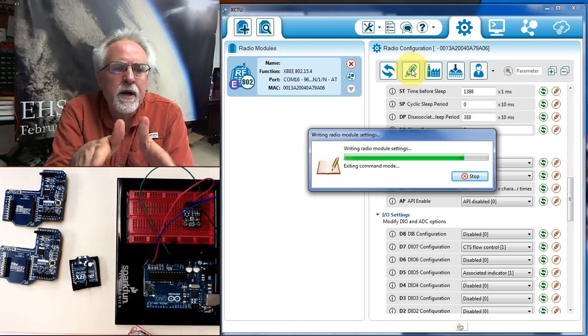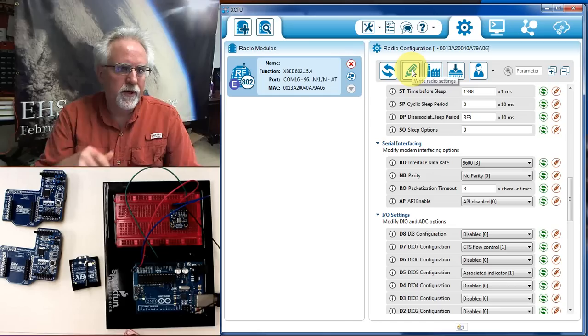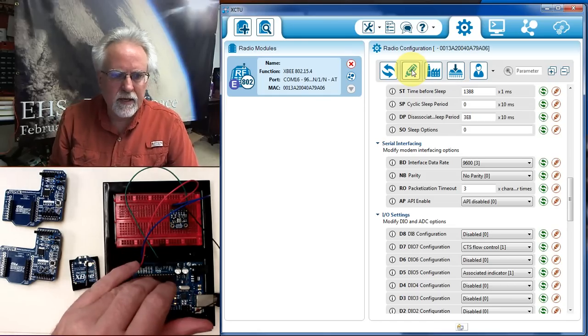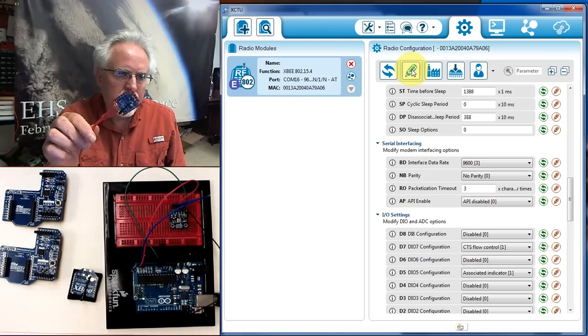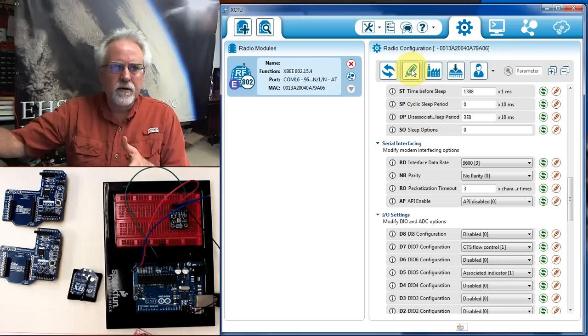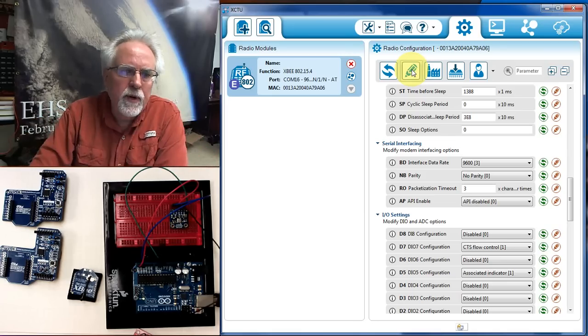Guys, on projects like this, you've got to make sure that the baud rate is the same everywhere. So when you've got to do a serial begin in your Arduino program, serial begin 9600. Arduino side radio 9600. PC side radio 9600. When you go into Python or a serial monitor or whatever you're using there, 9600. You got to keep that all the way across.